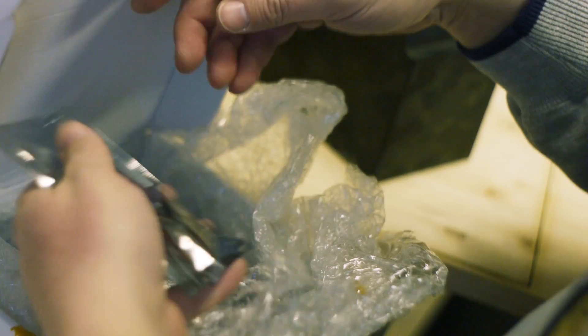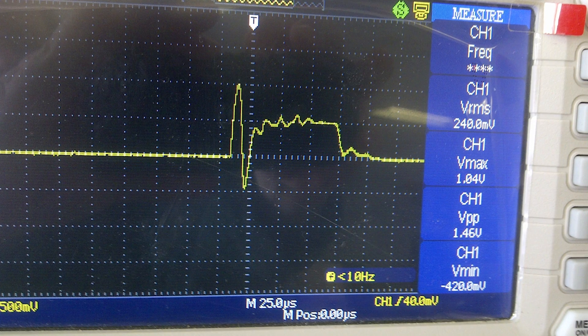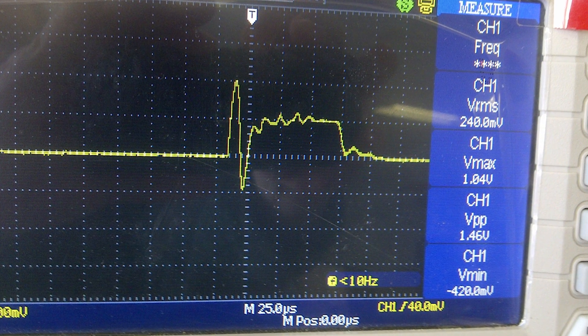We did a little more investigation and discovered that even though the 20 milliwatt laser only draws 60 milliamps on average, on startup it had a 4-amp spike and 2 amps for about 75 microseconds. That might not sound like a lot, but it basically prevented the laser from ever turning on through a smaller transistor FET. We ended up going with a tiny 10-amp FET that is relatively inexpensive and turned the laser on beautifully — so we solved that.